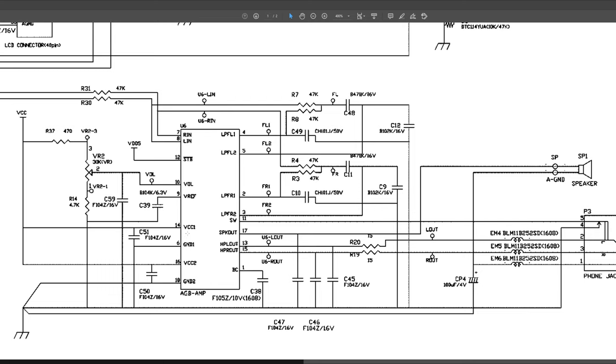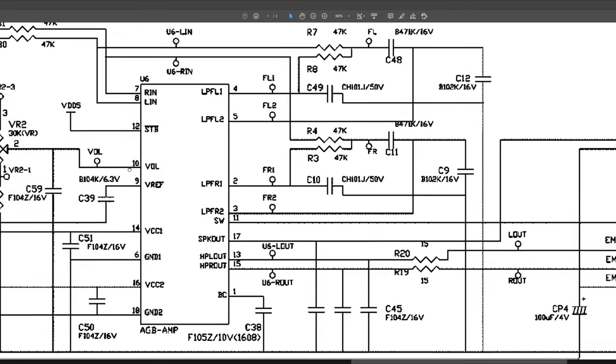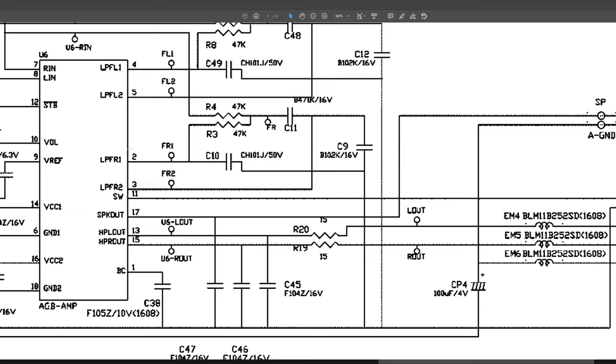Same for pin 16. So if you're having issues, the natural steps would be to check, do you have ground? Is ground connected to ground? Do all the VCC and VDD pins, or ones that show they go to VDDs, actually have power to show that this chip is capable of running? And then you just make assumptions from experience as you go. So the thing that says vol, you'd expect to mean volume. You'd take a working board and measure the voltage here on a working board when you have audio and compare it to a non-working board to give you an indication if something's wrong.